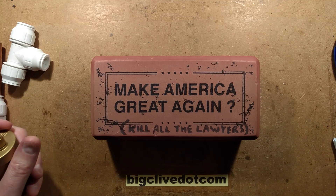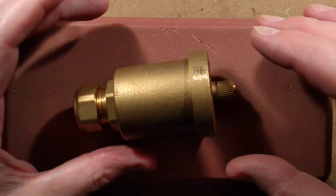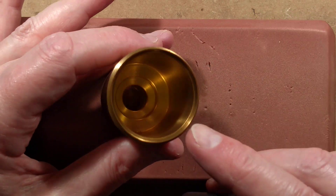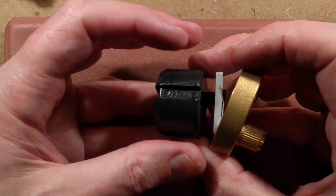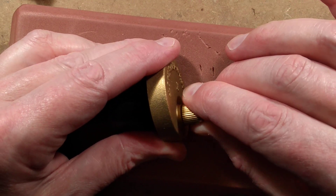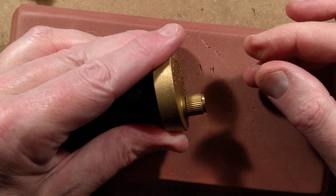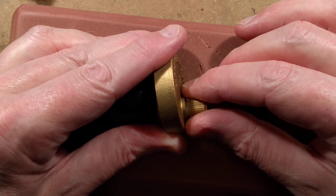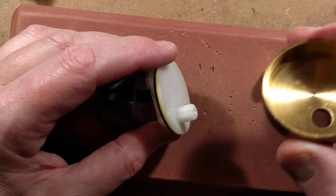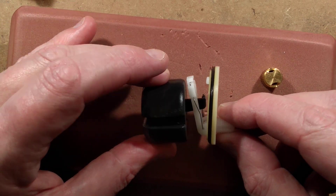This system has a little valve in it that allows the air to leak out but blocks the water. I'll bring in a height reference — the trumpy brick — and zoom down to look at this. When you open this up you find inside there's a little float. This bit here is just the brass cup. If you unscrew this, it's notable that this is the valve that the air release comes out from, but if you screw it down tightly no air will come out at all, so you have to just back it off slightly. The point of that is if it ever gives problems or leaks, you can just screw it up — once you're finished with it or if it ends up seeping water, you have the option of tightening that up to stop it.